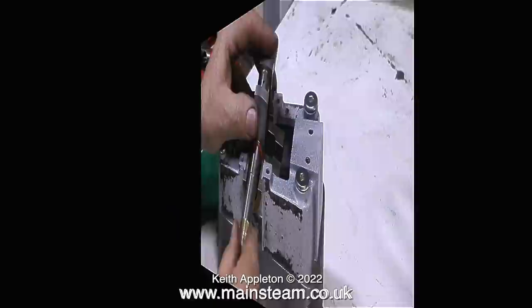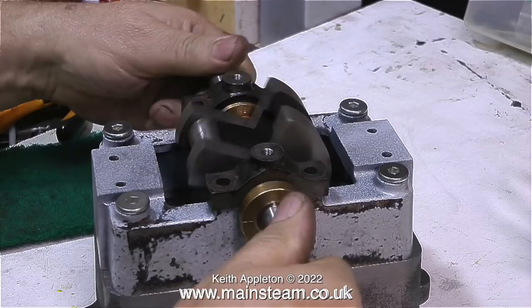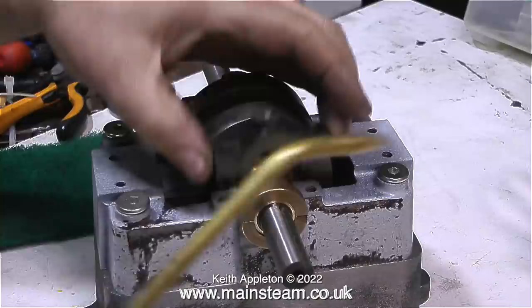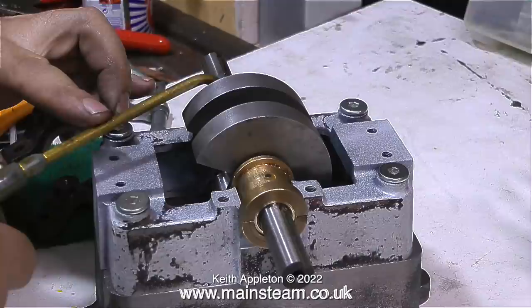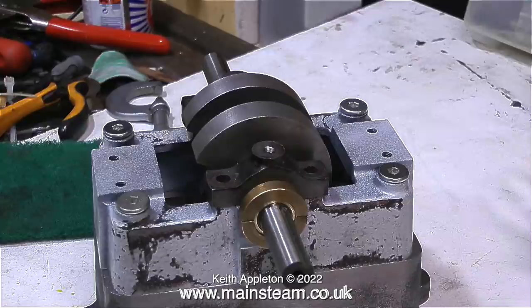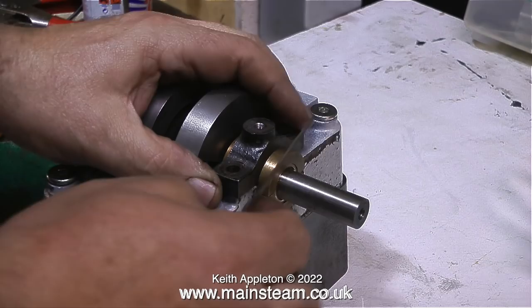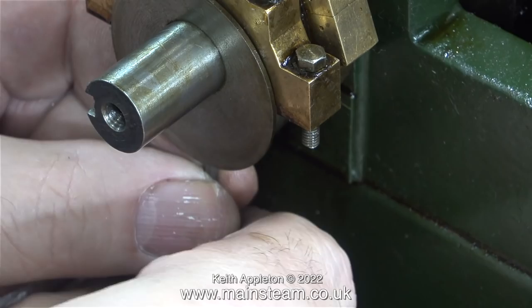I've also used silicone o-rings on crankshafts to prevent oil loss down the front of the engine, which seems to work well. As I'm experimenting, I'll fit oil seals to both sides of the bearings by machining a small amount off the ends of the bearing bushes, allowing the o-rings to locate neatly into the main bearings. I've worked on quite a few Stuart 5A engines and the bearings often wear to the point where the top caps become ineffective clamps, and I've also seen scored crankshafts caused by over-tightening. This simpler system means when the bushes wear, you just loosen the top caps, remove the bushes, make two new ones, and refit — only the flywheel and valve gear eccentrics need to come off.